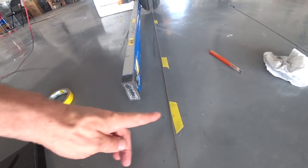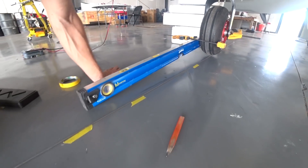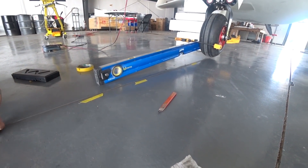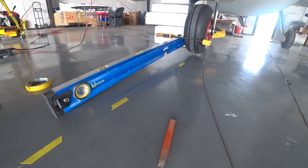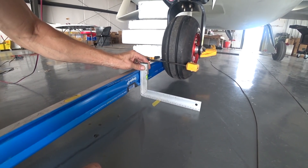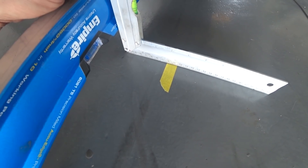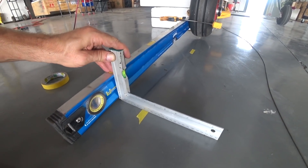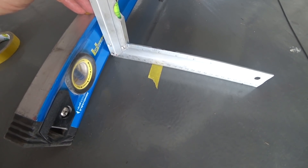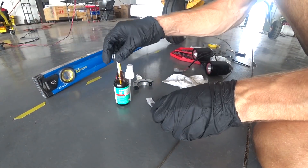You can see the first bit of tape and the wire being held down by my heavy bag, all lined up along a taut cable running front to back. Once that's done I move the cable away and just have my marks on the floor. I use a T-square with a millimeter scale to measure from the inside of the straight edge to the tape, making sure it's the same at the front and the back. Initially it was a little off from where I had it before, since everything was only lightly bolted.